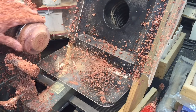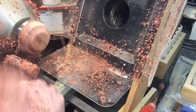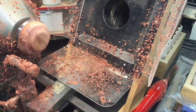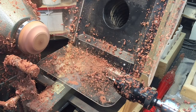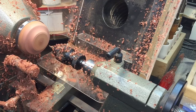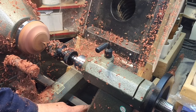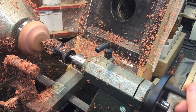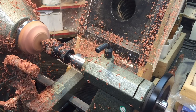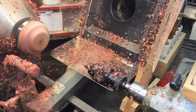You can see from the knots in here. You can see the chips are crazy — it makes so many because the wood is so dry. We're going to bring in our tailstock now, move the vacuum back a little bit, and we're just going to pilot drill a small hole before we do any more. We have a center bit in there to pilot drill a small hole, and we'll enlarge on that later.